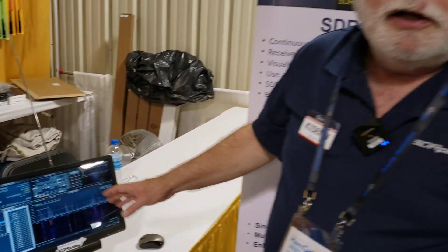As an aside, this is also completely powered from 12V. My intention was to have an implementation that you could use mobile, so the monitor is 12V, the mini PC runs off 12V, and of course the RSP itself runs from the USB port on the mini PC. So theoretically, I should be able to operate this in my RV off the 12V supply with no need to run inverters and not picking up any extraneous noise.